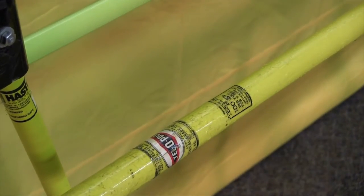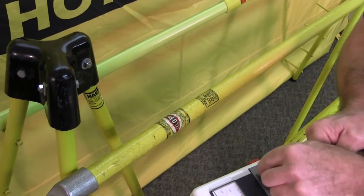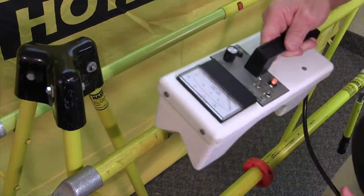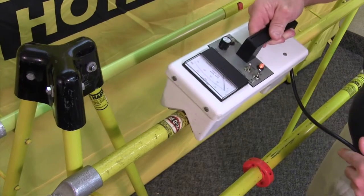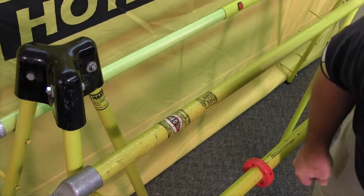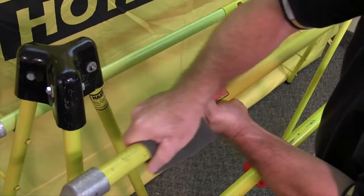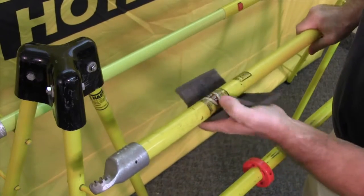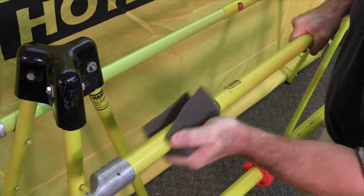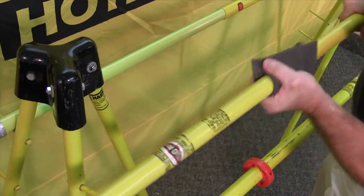That doesn't look very good. Let's put the tester on the wet test. I've zeroed my tester out — that's maxed out the tester. That has failed. We've got a bad spot on the end there. My next step is to get a scrubber pad and put some of the cleaner on it so we can clean this up. I'm also inspecting this — I'm looking for cracks, possible holes where it's been dropped, anything that can cause tracking on the end of this stick. I can tell by the logos on here, this is very old. So we'll give it a good cleanup.